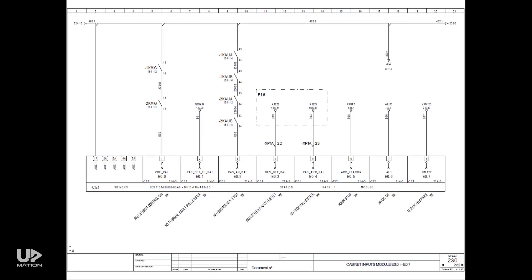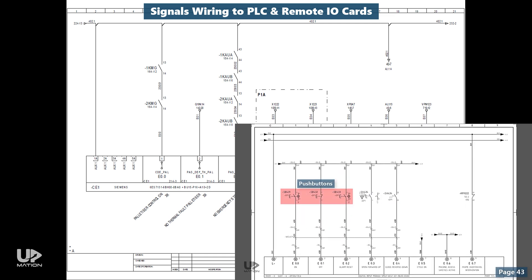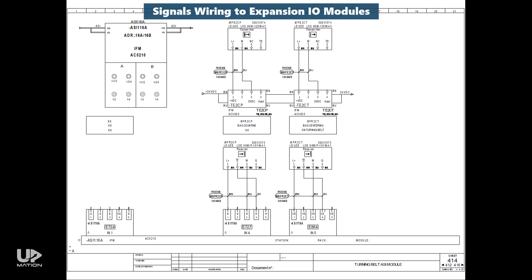This section illustrates the connection of sensors, transmitters, and other instruments to the PLC's local input and output cards or to remote I/O cards. This might seem familiar, as we have discussed the same part in another wiring diagram in a previous video. There is also another type of signal connection drawing to quickly skim — since this specific machine has employed AS interface, you will encounter this kind of layout as well as the ordinary PLC type of I/O connections.